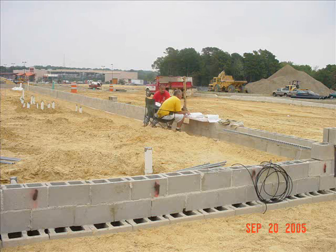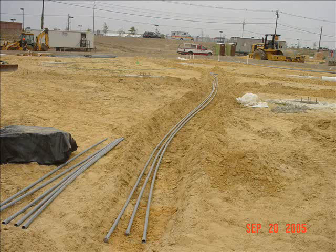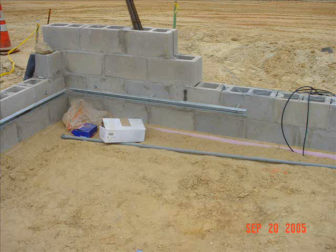Some early pictures of the site prior to the slab being poured. They're looking at our drawings. Here is about 8,500 feet of linear conduit that's actually put into the slab. This is the small jig used by the contractor to ensure that the stub-up locations were proper. We are going to actually offer a jig that will be embedded in the concrete to ensure quality.